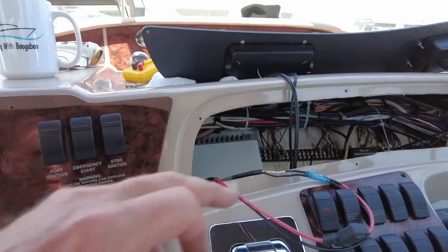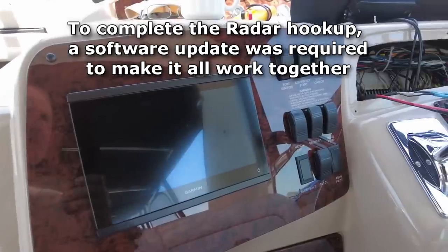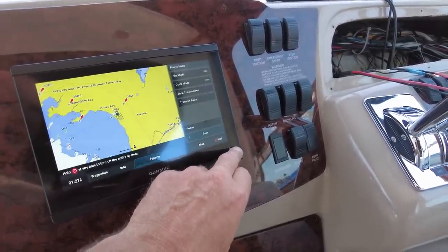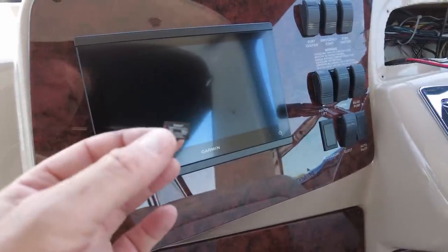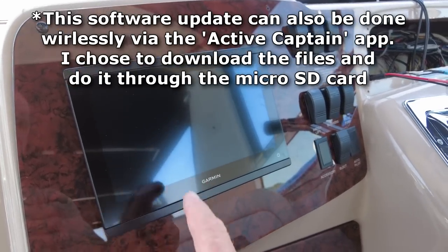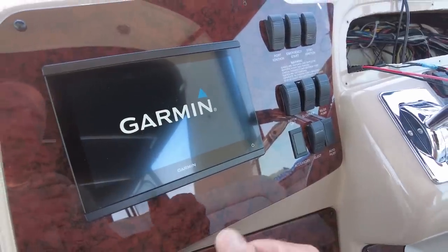I just did the final power connection for the radar — there's an inline fuse and fuse holder that came with the whole assembly. All I have to do now is pop this unit out and update the software. I'm going to put this micro SD card in which has the software updates, plug it into the back of the unit, and fire it up. It should run through a welcome menu asking if you want to do the software update and then do its thing.